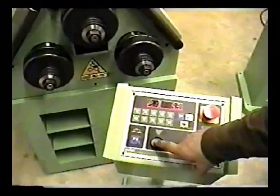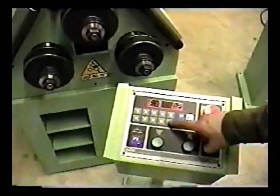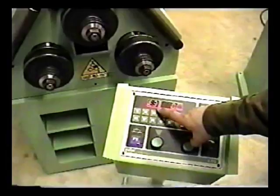Programming is very simple. Notice we press P for program. Here we had our E value of 10, which was our first position. If I want to change this to a 20, I simply add the value and press enter. Now this prompts us to enter position 2. I can enter position 30 — this is useful if we have multiple bends per piece or multiple passes. Press enter. Now it prompts us for the next position, position number 3.